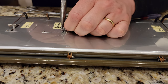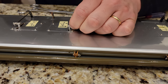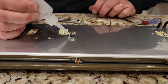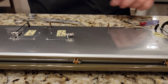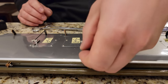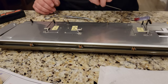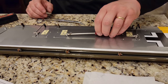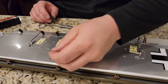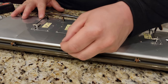Okay, so I'm just going to torque this down somewhat so that I can get the threads exposed so I can put some glue on it. Okay. So then this one here, my concern is I don't know if I can shorten it or not because I don't know the neutral state of a leading edge slat. Got to back that off just a little bit further, just like that. And then this is not glued at all, and that's the way it's going to be until we are done running it in and out.